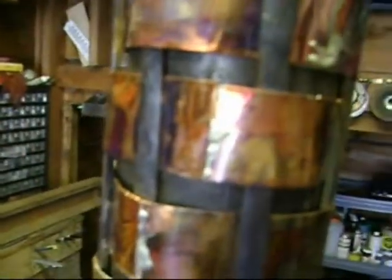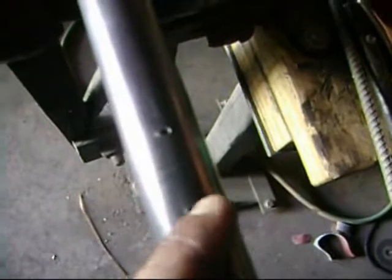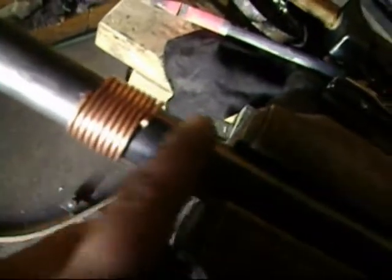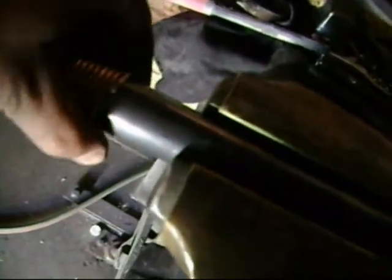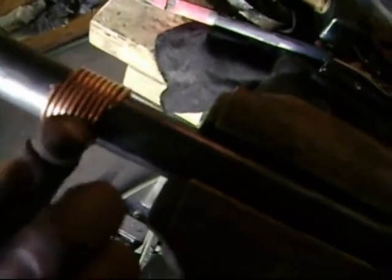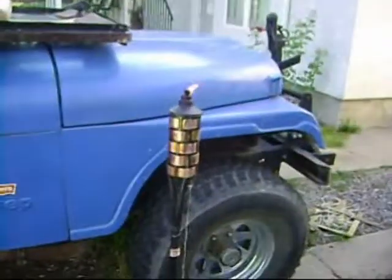You can see the silver solder is poking out there a little bit, but all I have to do is sand that off — it'll be gone, you'll never even see it. I got my first wrap on; I have one more to do. All I did was drill two holes, just bigger than the wire — I didn't want it to be the exact same size, otherwise it'd be too hard to get inside the hole. Once you start wrapping it, when you get to the end, cut off your wire and leave it about an inch or so, make a coil, and you hammer it into that hole. That little coil is going to go inside the pipe and kind of get locked, so this thing ain't never coming off.